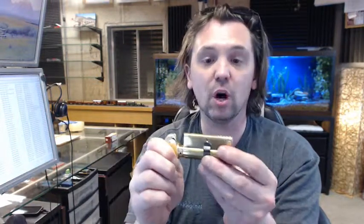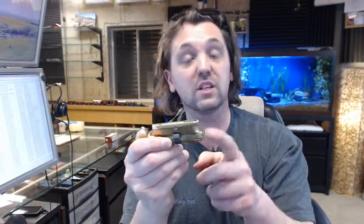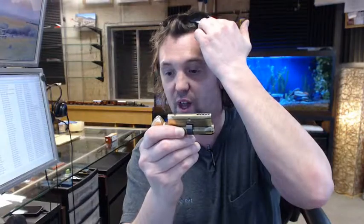If you know what I mean, you know what I mean. If you don't, that means you cannot run 6-pin length keys into these cylinders. So if you had commercial locks installed on the rest of the home or office and they take a 6-pin key, it's not going to be compatible with this lock because it won't physically operate or go into the lock.